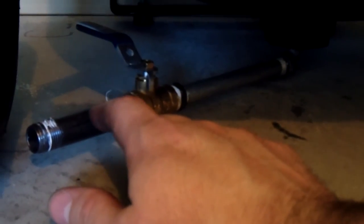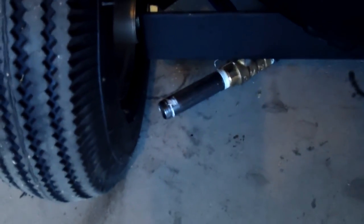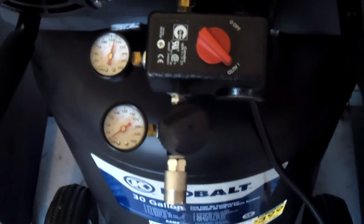I'll probably go with a shorter nipple here — this is a 3/8", I think 3 inches. I may try a 2-inch so it's not right on the wheel. I had a 90-degree elbow on there but took it off because it almost touched the floor — I may put it back on with a shorter nipple to direct the air away. I'm wearing safety glasses — probably a good idea. I'll give it a little blast and shut it back off. It works really well. No moisture in there right now, but you can give it a quick blast to get any moisture out while keeping it nicely pressurized, without worrying about blowing out O-rings or having your drain valve stop working. Thanks for watching.